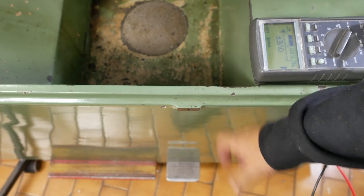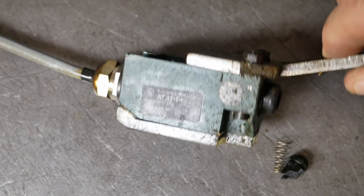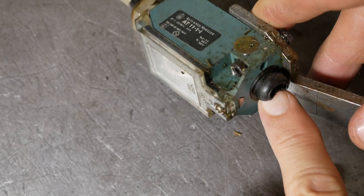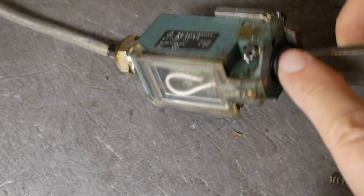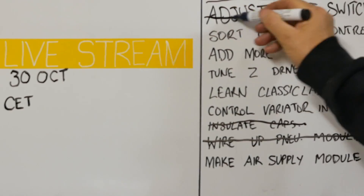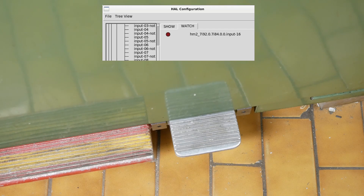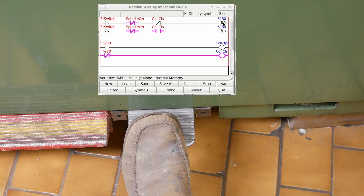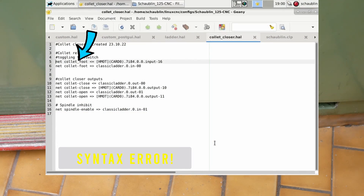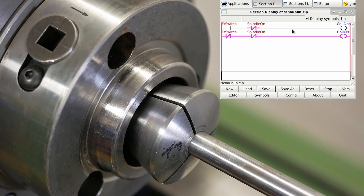While adjusting the collet closer switch was easy, this is my e-stop switch and it's broken. Definitely lost some part out of the guts of this switch - there's a broken plastic bit here, a spring, probably a push rod or something's missing. I think I'll just replace it. I've wired that in - on, off, that works. But I'm not getting any change in the state in Classic Ladder. Here I've got 'collet-dash-foot' and there I've got 'collet-underscore-foot' - a naming typo.